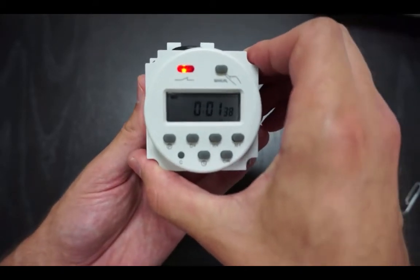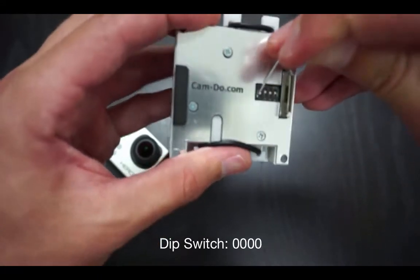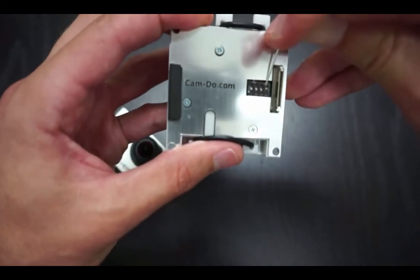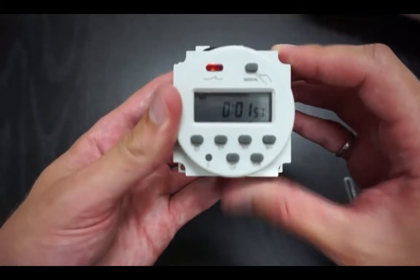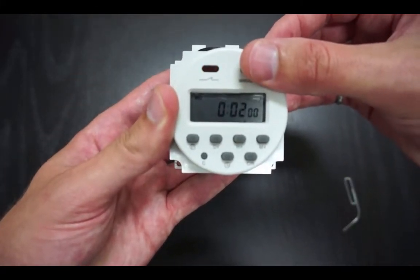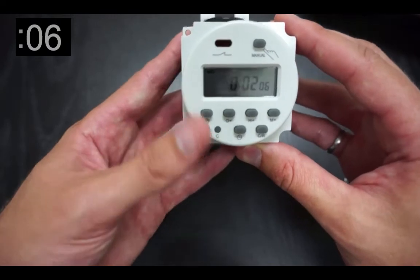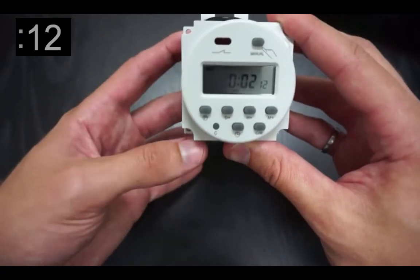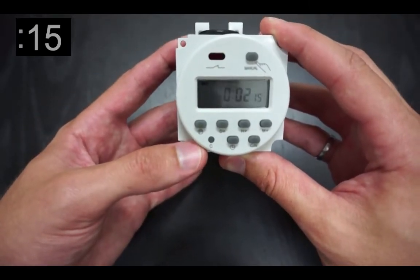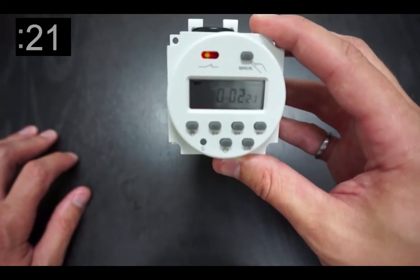At 40 seconds, unplug the scheduler and set the dip switches to 0000 (down, down, down, down) and plug back into the camera. When the seconds timer reaches zero, press the manual button twice so that the light bulb icon shifts from the right to the left and has the X removed from it. You are now programming the interval that will be repeated when the scheduler is active. The LED at the top is blinking roughly once a second and can be used to time the interval; however, it is more accurate to use the seconds timer on the scheduler.